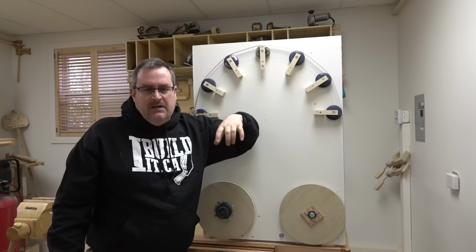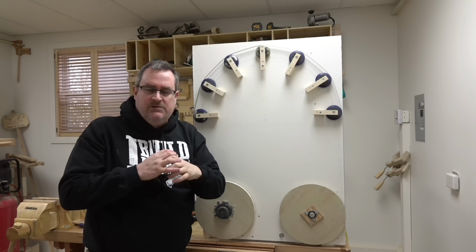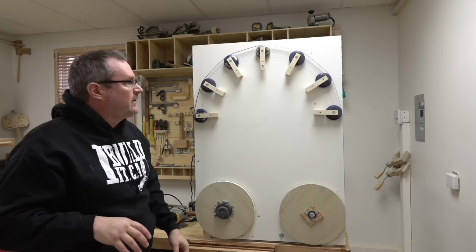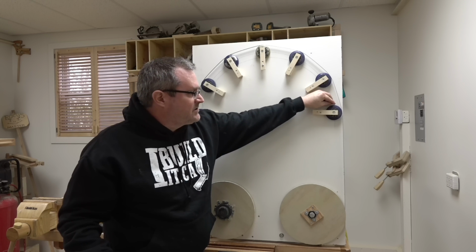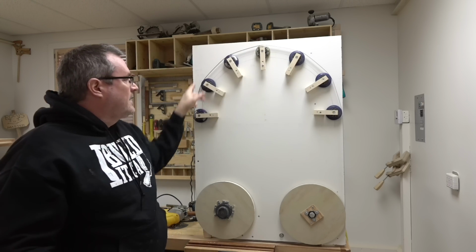I think they may be a little bit bigger than they need to be, so I think it would go somewhere around 2-inch. I've got 2-inch wheels on my belt grinder, and they're holding up well, so I don't see a problem here. And there would be a lot more of them, so there would be pretty much just like a 1/16 of an inch between the wheels as they go around this arch.